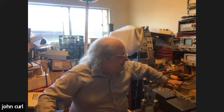But with a normal tone, like we're doing with these test tones, it's a breeze with the same amplifier. But when you go to TIM, we have a different kind of test. The TIM test is rather complex, and I don't have it here. It's what we call a sine-square test. The normal harmonic test, if instead of 1,000 cycles we test at 20 to 50,000 cycles, for example, and we look at this little amp, it's not going to TIM very much. But if we look at a solid state amp, we can see if one's going to have TIM or not, just with a sine wave. We don't really need a special TIM test, except for calibration of what the distortion is.